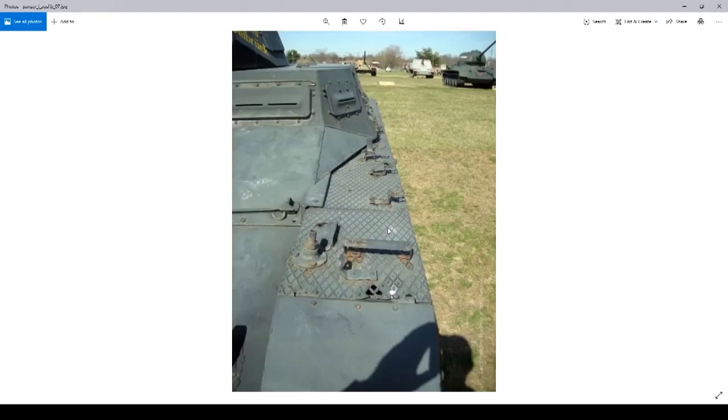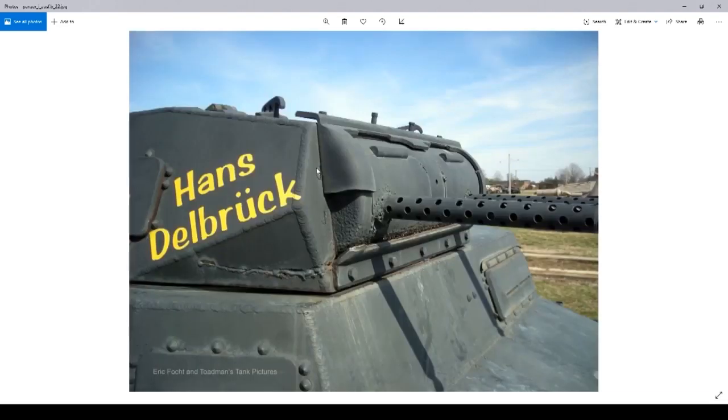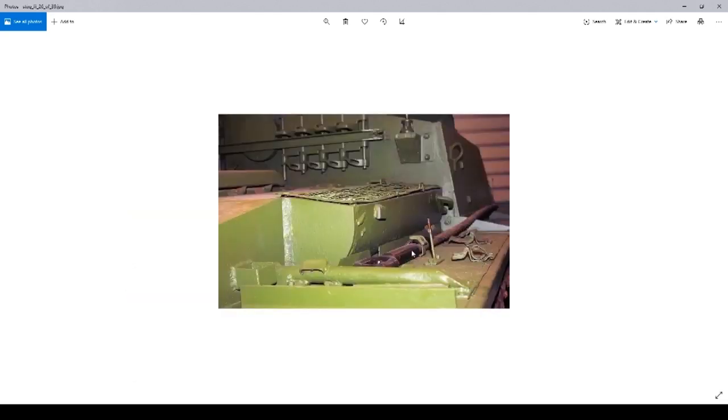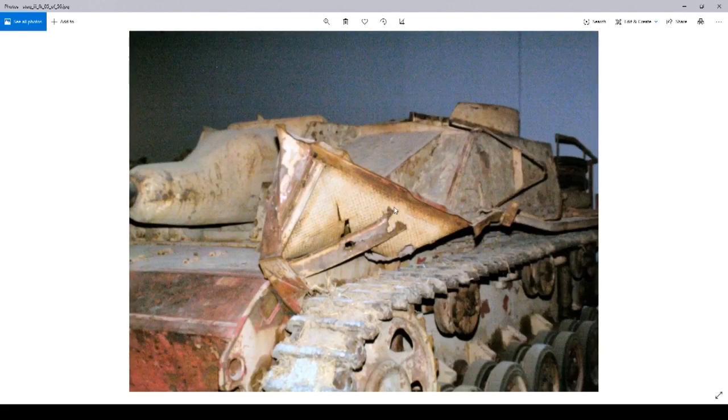Panzer I — these are a little more round than mine, exactly like my Type 1s but just a little rounder in general. Was that just because of where they were made or a variation? Fort Benning Stug, one that used to be at the Patton Museum. I labeled these for a guy in Thailand building a Stug because I wanted him to know what he had to make — he didn't want to buy originals, he wanted to remake them. This is a specialized Type 1 C-hook clamp that I labeled for him. Here's a Finnish Stug with original German clamps, Type 1s on this fender. But this is the Stug I'm primarily using as reference to show a point.